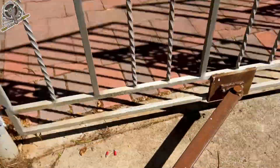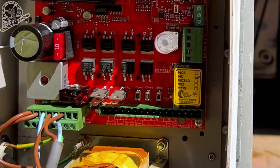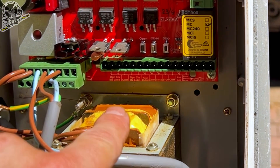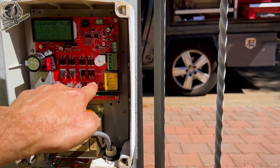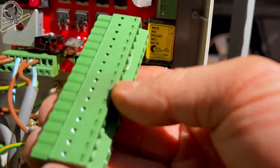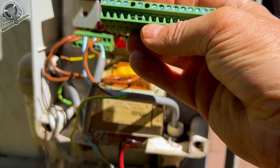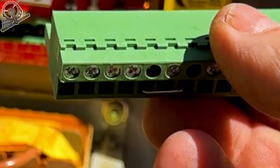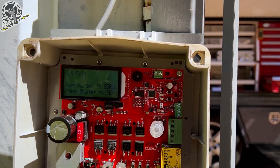Learning is successful. The gate is closed, which is pretty much correct — we just need to adjust those limit switches. That gate is pretty much perfect. Now we can use the open, close, and stop buttons to open the gate. We'll stop it and then close it to see where we're at. There's a small link here — that should deactivate the photo beam. That lines up perfectly, so that will disable the PE beam and then we should be able to exit.